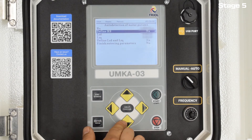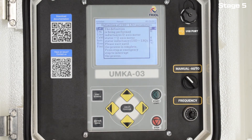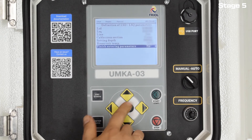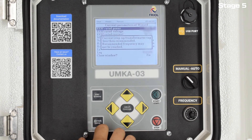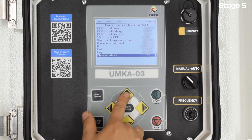Select the inductance measurement: in the Define LSD and LSQ item, select Yes and then move on. To activate the mode of measuring the inductances of the motor, press the Start button, after which the VSD will charge and proceed to the determination of the inductances. It will take some time for testing. During testing, the VSD can make sounds of different keys — this is normal. The LSD and LSQ values can either be the same or different, depending on the design and features of the particular motor. If you cannot complete this stage, then you missed one of the steps for measuring resistance or measuring inductance. This window contains the data of the motor and the values of the resistances and inductances that were measured in the previous step.